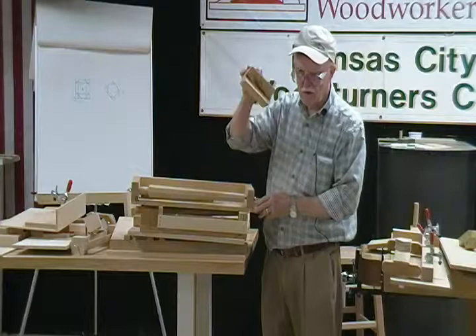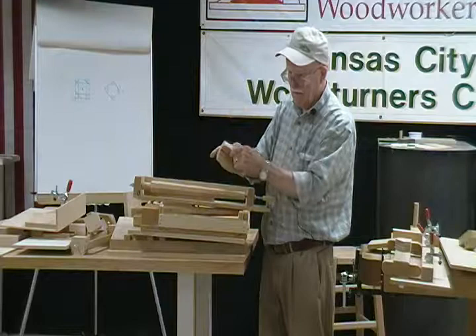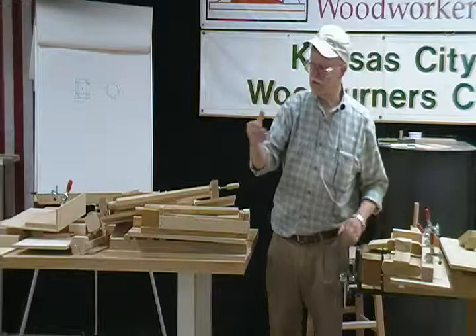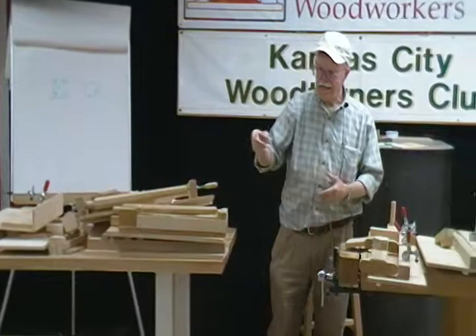Think about what you have to do, because a lot of times you have to make an auxiliary piece that is your reference fence. We've got a fence here that establishes this thing, but this establishes the attitude of the workpiece to the blade. If we go back to our original slide, the things we have to do: establish a cut line, establish the fence, clamp it down. And now there's a sixth element — we have to index it.